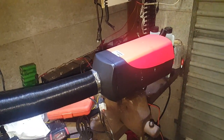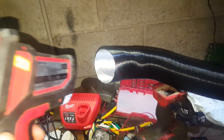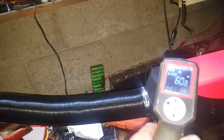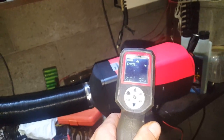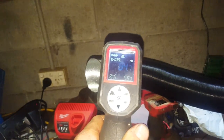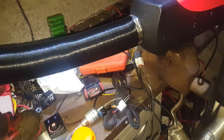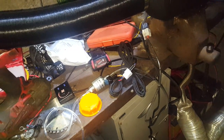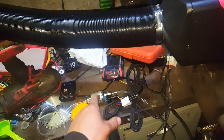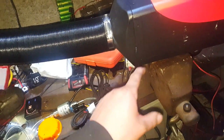I'm going to set a few of these up for people — this one's for a customer. I've got to set it up in the shed to test it and the customer really doesn't mind. The heat coming out of there — you can't actually hold your hand in front of it. The temp on the body of the unit is 40 to 50 right on the outlet. Realistically the airflow and heat coming out is in the 80s. Because the pump's a piston style, plunger style pump, nothing gets back behind it. So even though there's air in the line, it will still pressurize the diesel that's in the line and get it up and into the machine.